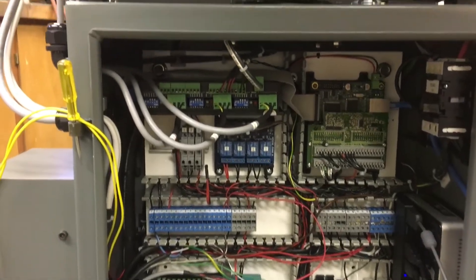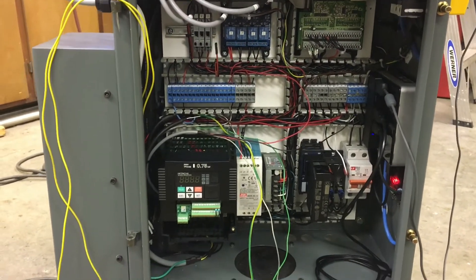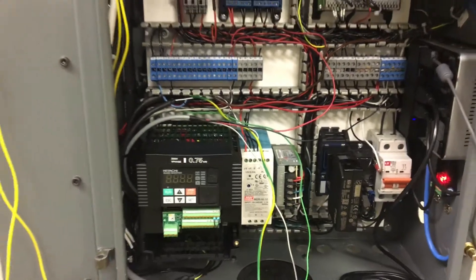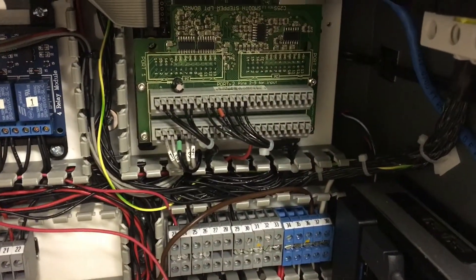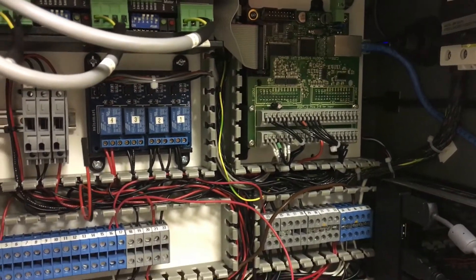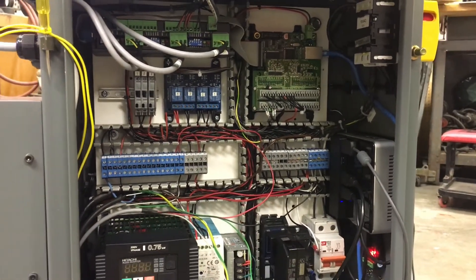This is what I've been working on. I'll try to take a little tour. This is the classic ten pounds of stuff in a five pound box, but we got it done — it's definitely tight. I'll have to tuck in a couple more wires. We don't really have all of the input/output stuff like the VFD and some control wire stuff hooked up yet, but we'll power it up and take a peek. That's the ESS with the C25 daughter board on top, and I printed a little bracket to hold all of it. That's the input and output stuff — the buttons.